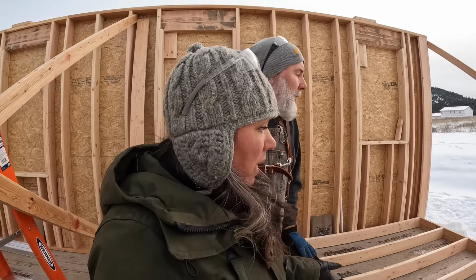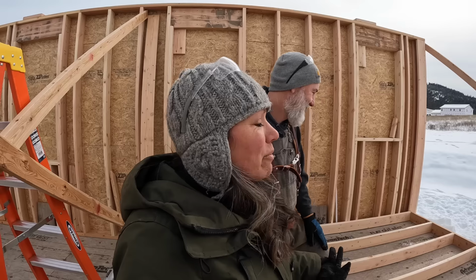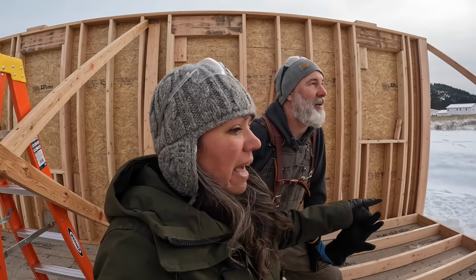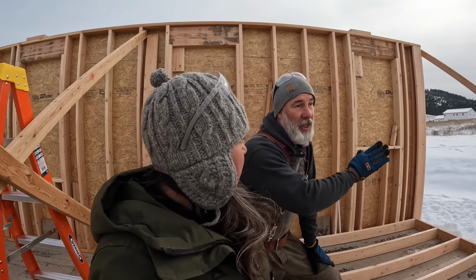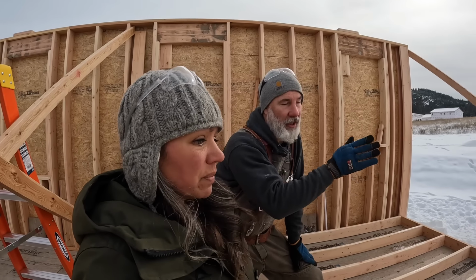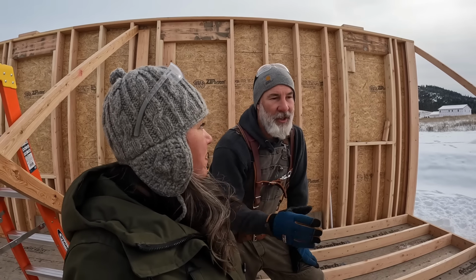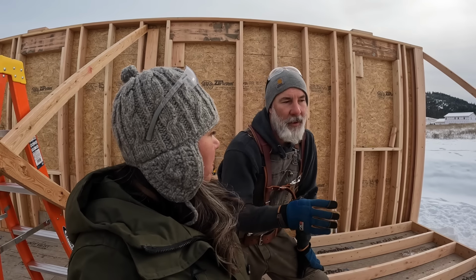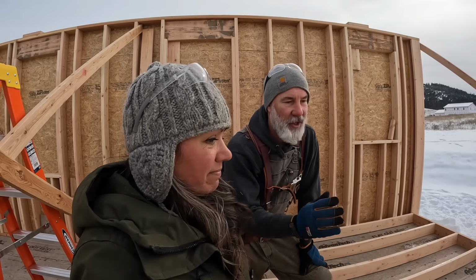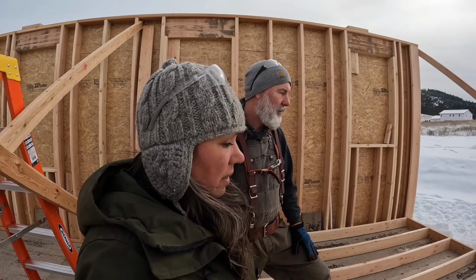All right, so we got this wall all framed and we were about to start sheeting it, and then we realized that we would only be able to put one piece, because we really need it to overlap on both sides. And we can't do that with the other 2 walls not done. And so really the sheeting needs to actually continue past this wall and go onto the garage wall. So we wouldn't even be able to do that till after we put that up. And this sheeting does not like to get wet, and so we don't want to put any sheets on there without the edges being sealed. So why bother putting one sheet on here that's just going to get swelled up if it gets wet. So yeah, I threw a couple toenails in, so I think we could pick this up without the wall jacks. I think so too.